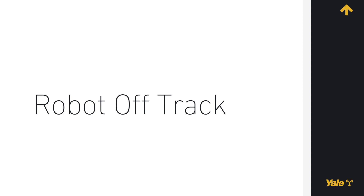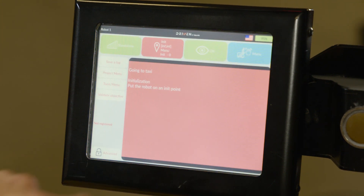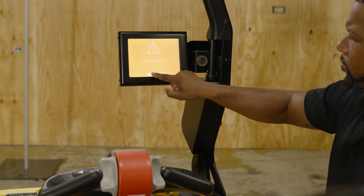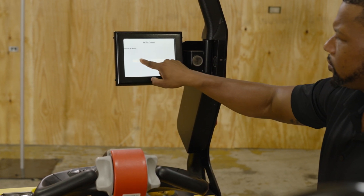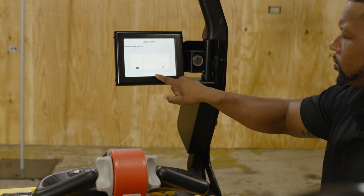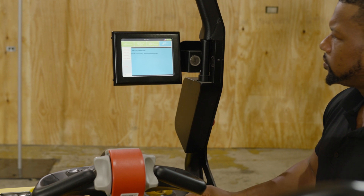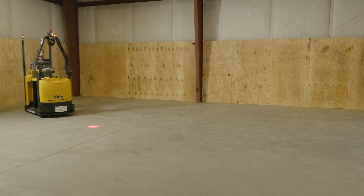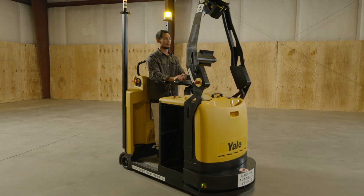Robot off track. The following screen displays, solid, the name of the initialization point that has been selected. Press the OK button if the correct initialization point is displayed. Otherwise, press Cancel. If you press Cancel, restart the initialization procedure and select the correct initialization point. If the robot has been correctly initialized, a beep is heard and the two warning lights flash. The message Init OK and a score are displayed in the main frame of the touch screen. If initialization is not successful, move the robot and reposition it on the initialization point and then repeat the initialization procedure.